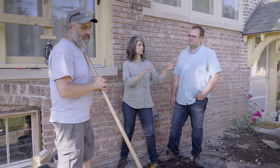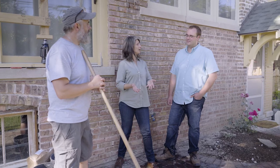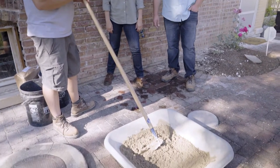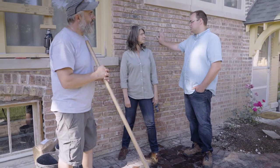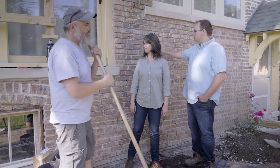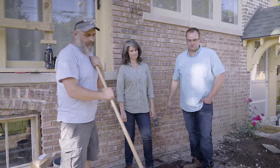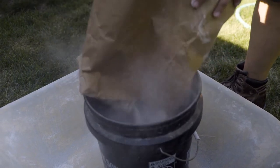Right now we're looking at a lime-based mortar. Matt has had a ton of experience working with historic lime mortars, so that's what we're using today. Going back to our first episode, we know that this is a pre-1930s building, so we want to make sure that we use a soft mortar, and lime mortar is perfect for that.